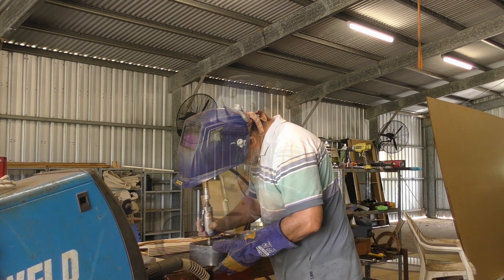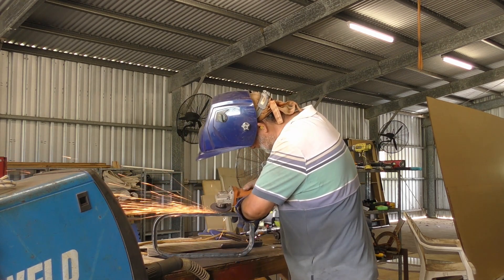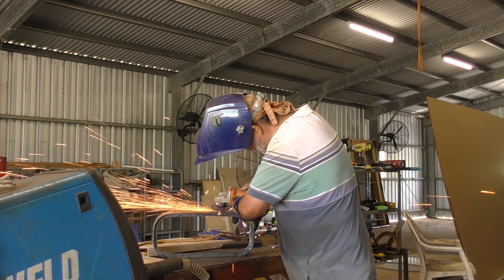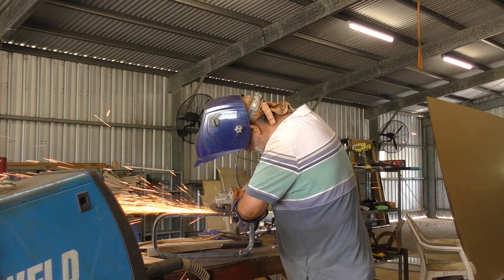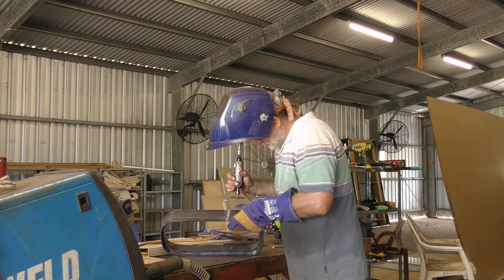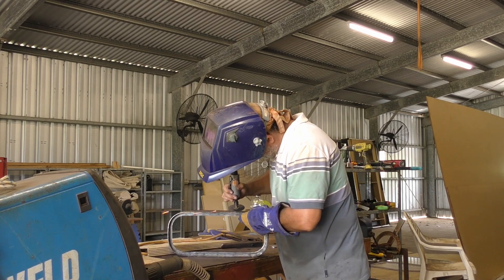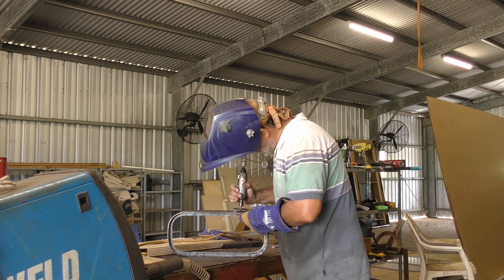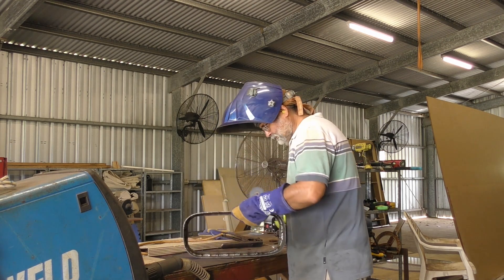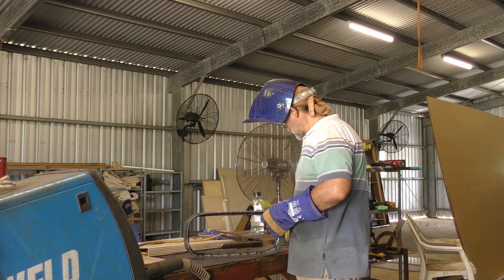Here you can see I'm just finishing off tightening up the butt weld between the two ends of the outer part of the framework, just tidied up so it's nice and flush. It's got to fit through the side of the cabin wall so I don't want it snagging. The final step for that part of the process was running over the outside again with a die grinder and a fine cutting disc to tidy up the edges. Some people might think that's unnecessary, but I think it's good practice and it's something I like to do to complete things properly.